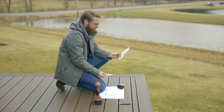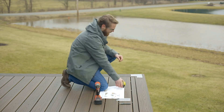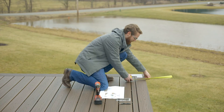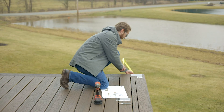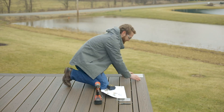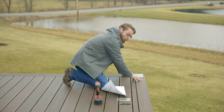To set this template in place at a corner, on an outside corner we want to take into account the outside bull nose or overhang of your deck. On this deck here we're going to measure that bull nose. We've got a one inch bull nose on one side of the corner, and on the opposite side we also have a one inch bull nose. In setting this template in place, we want to position it so that the mounting screw is going directly into the backing underneath the finished material, and that it's offset one inch from the bull nose.